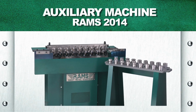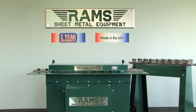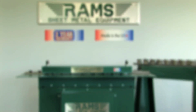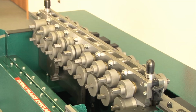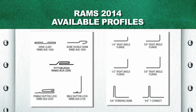RAMS 2014. As with all our RAMS equipment, the RAMS 2014 auxiliary machine carries a standard 2-year warranty and is 100% American-made. The RAMS 2014 is equipped with a 5-horsepower, 208/230-volt single-phase motor and runs at approximately 50 feet per minute. This one-of-a-kind 9-station double-sided machine is capable of producing 11 different profiles, saving time, space, and money.